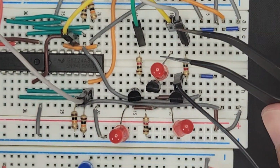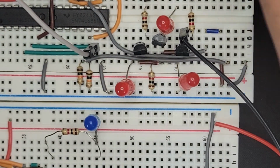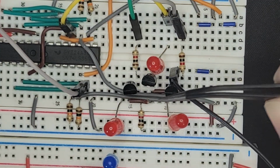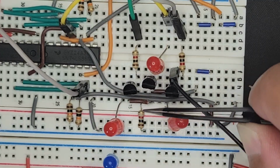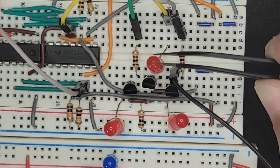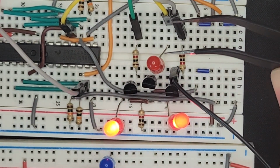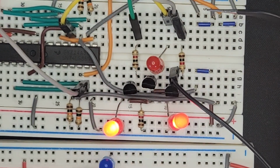So I think this solution worked, where we just put the LEDs first before the transistors, and we ground it with the resistor. In this case, we no longer get false positives, because when the cable lights up the signals, then it goes into the bases of these transistors and goes out to emit. So it is not able to go through the LEDs. The LEDs are only illuminated when the current, if there is current, coming from the bit can be grounded. So this seems to have worked. I guess I'll set it up this way for the other two, and then that should be it.